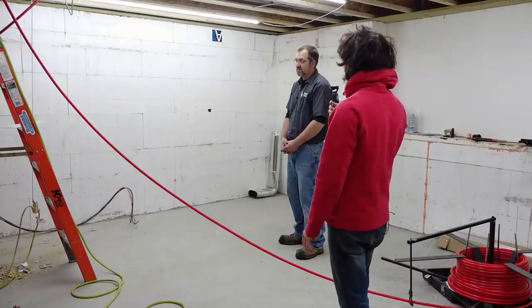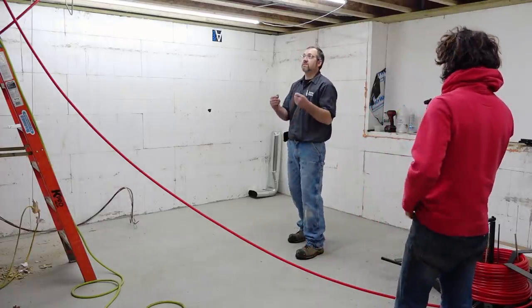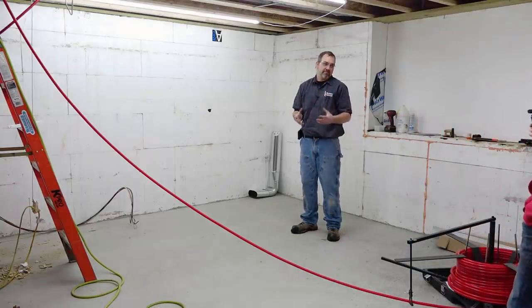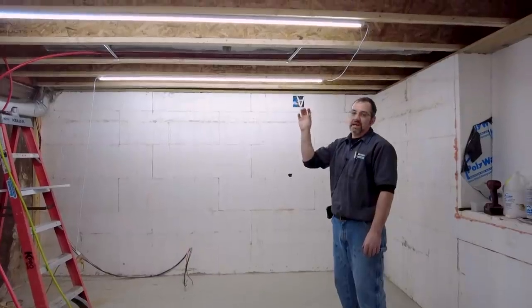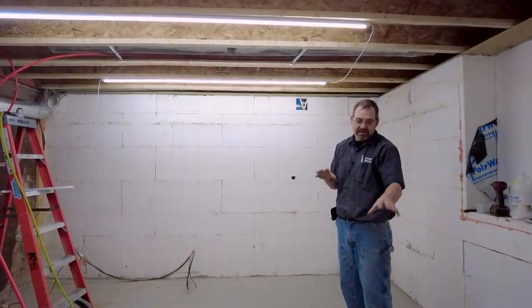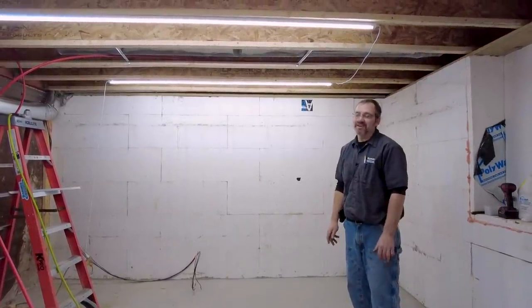So how does the PEX press into the transfer plates for this stuff? Once the tubes get heated up, they soften up. So these panels are designed to really keep the tubes squeezed. And when we're putting them in, fresh out of the roll, they are very difficult to get in.